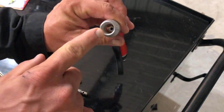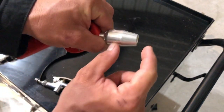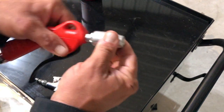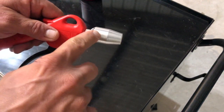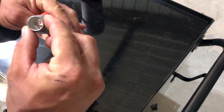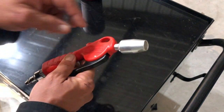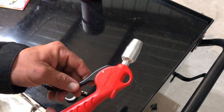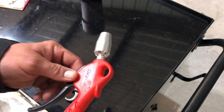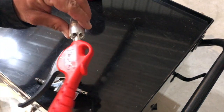The outlet hole from the air gun into the venturi nozzle is large. The venturi nozzle is long, so there's plenty of room for venturi effect to occur, which means a little low pressure zone is created back here — it sucks in air and gets nozzled towards the front where it shoots out more air. Snap-on claims this thing can put out up to 21 cubic feet per minute of air, and I can't measure that 21 CFM, but it does blow really hard.